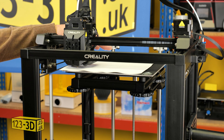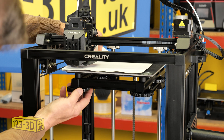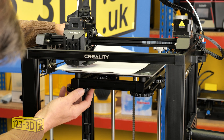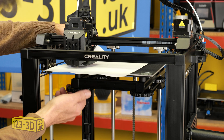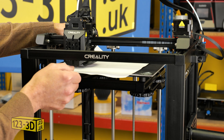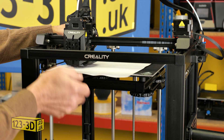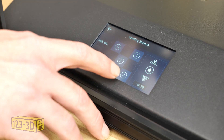I'm going to take a sheet of paper, placing it between the nozzle and the print bed. All we're going to do is adjust the knobs until we have a little bit of friction between the printer nozzle and the print bed — just a little bit of a drag, not too much. Then we'll move to position three.